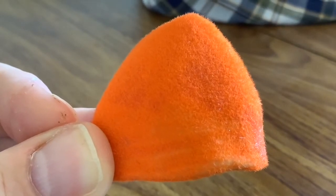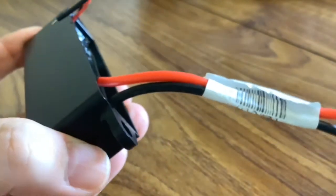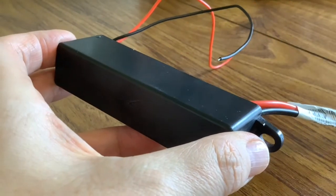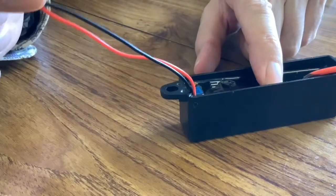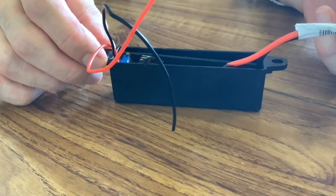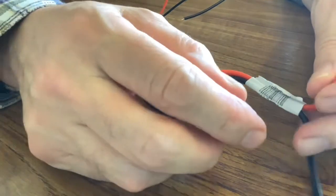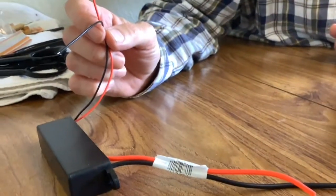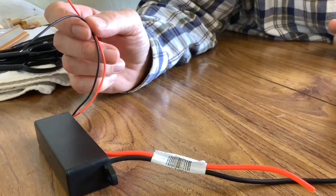The more professional way of applying flocking is to use electrostatic attraction. Paul ordered this to make something to use electrostatic in order to get the flock onto the adhesive. It's quite simple - it's just a high voltage DC generator. You put 12 volts in on the thin wires and you get 20,000 volts out on the thick wires. Now, that sounds like a very high voltage, and it is, but it's extraordinarily low current - it's effectively static electricity, like the sort of stuff you'd get on an old-fashioned glass TV screen. It can either be powered by a battery on the thin wires or a DC power supply. I'll probably use a DC power supply - I've got one and I can adjust it to the right voltage.